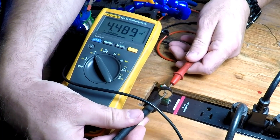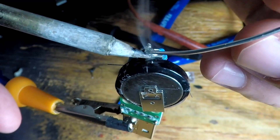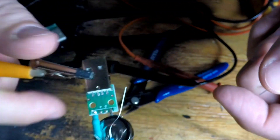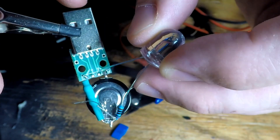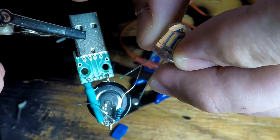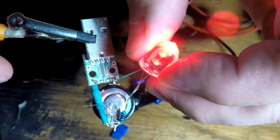You can see the soldering process there — I've got about a 12 ohm resistor on the input side just to regulate things and make sure it doesn't charge too fast, and then I've got the ground connected to the other side that goes to the ground at the USB-A breakout. To go to the LED itself I've got about a 200 ohm resistor going from the supercapacitor to the LED and then back to the ground.